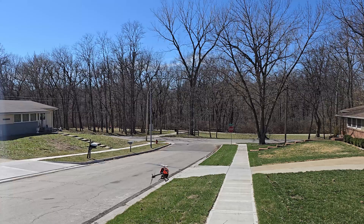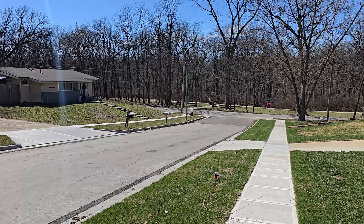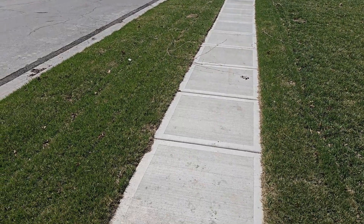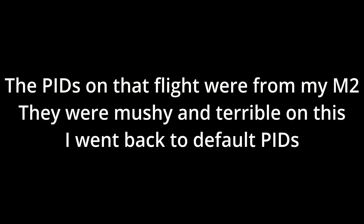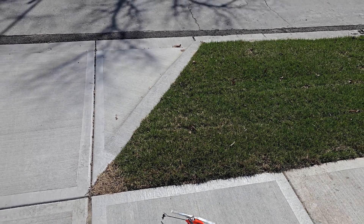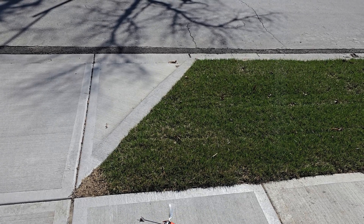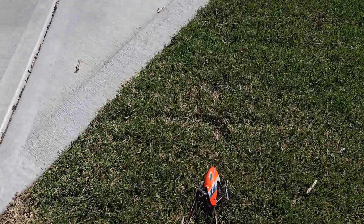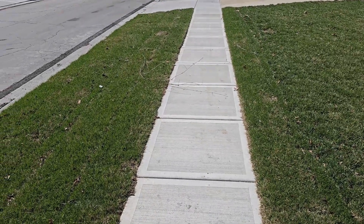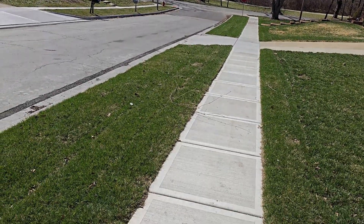Well, these PIDs are horrible, so I've got to change that. I dropped basically everything by half and dropped D even more. It seems like the micros need to have a really low D gain. Definitely too high.